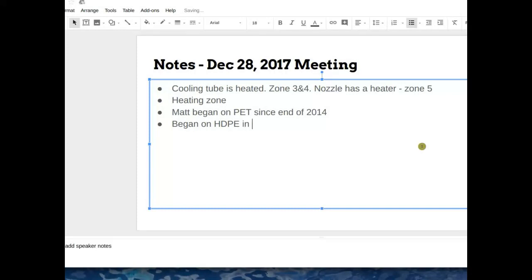So in 2012 you began with HDPE. Our first extruder used a drill for the motor - direct drive, no gearing, one heating zone. It was a piece of plumbing pipe with an end cap and a hole drilled in it. You could make the whole thing for like $100 to $120. No motor controller - we just used the same temperature controller you probably have with your Lyman filament extruder. The body was made out of two-by-fours. It was super cheap.